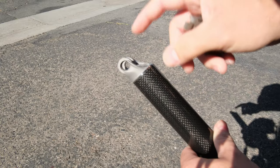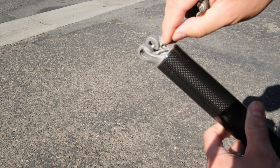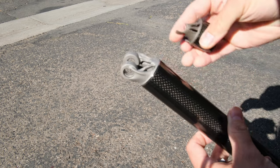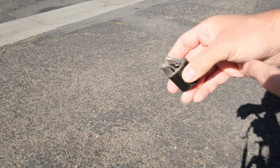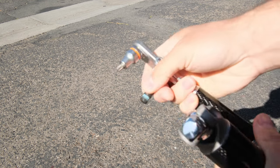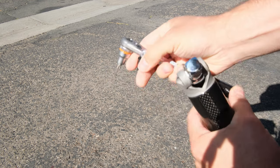This round we're going with tool steel and a much beefier design — there are a couple more substantial ribs down inside that were not there before. Fusion 360 said the previous amount of material was enough and it clearly wasn't. We're going to install this using our titanium flex head ratchet.